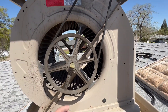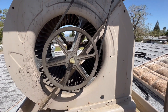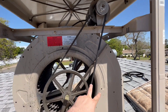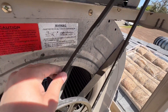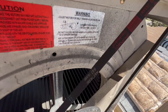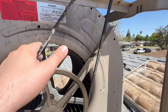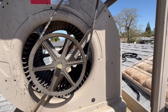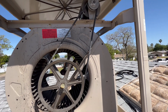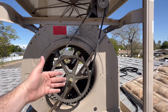If for whatever reason you're losing power or your squirrel cage sounds like it's squeaking, you might need a new belt. The belt size number can be found on the belt itself or from the manufacturer. It's also recommended to run an amp draw test.